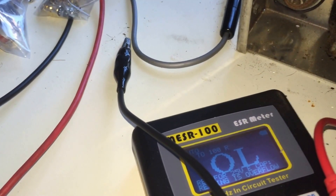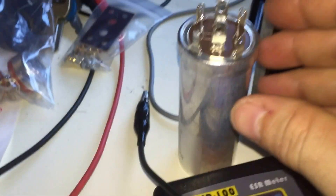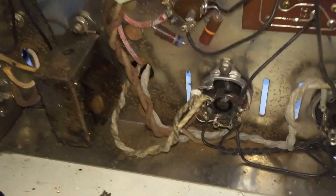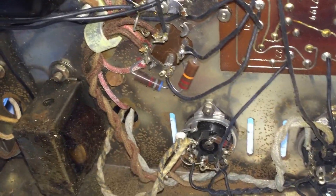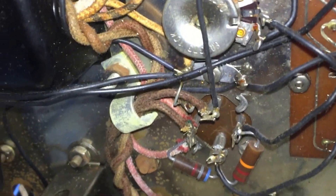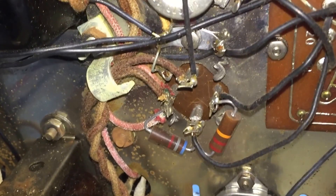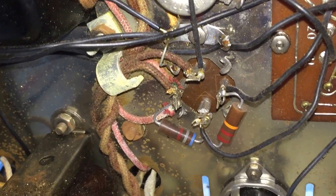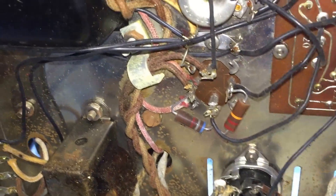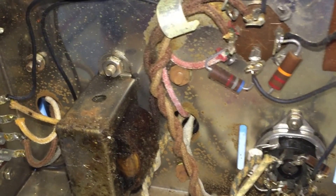There's no correlation between the capacitance values and the ESR — that's just what it was. This new one is good and it's going to replace the one that's in there. Once we have it in, we already have our negative bias for the tubes from the selenium rectifier. Without a working capacitor there's no way I'd put in the rectifier, so we're going to take the old one out and replace it. While it's disconnected, we're going to measure that RF choke one more time.